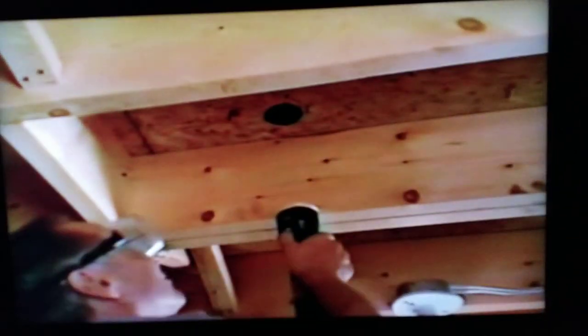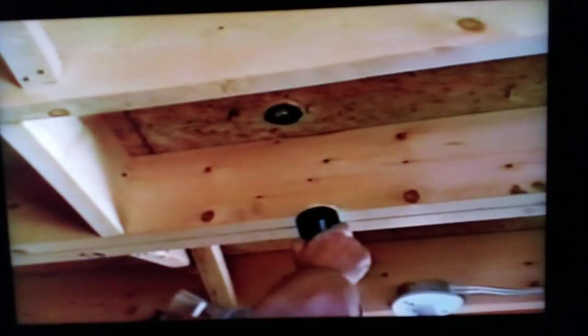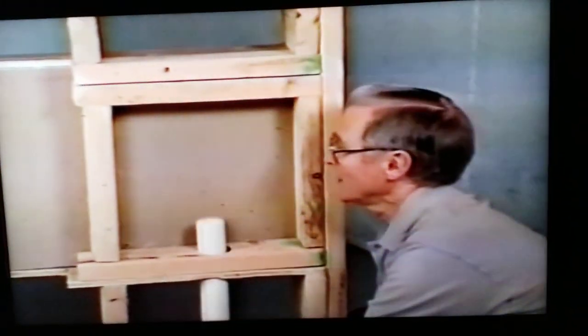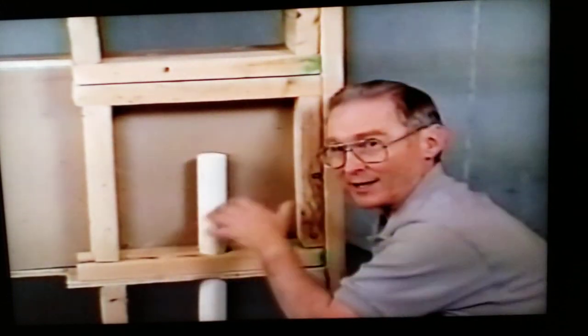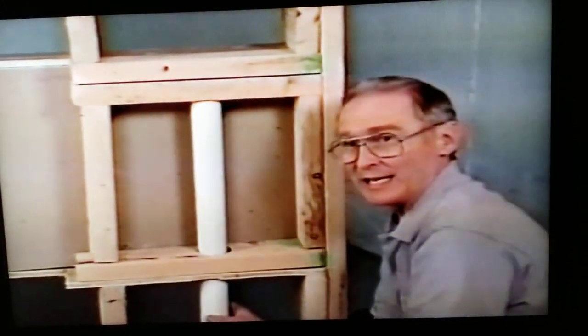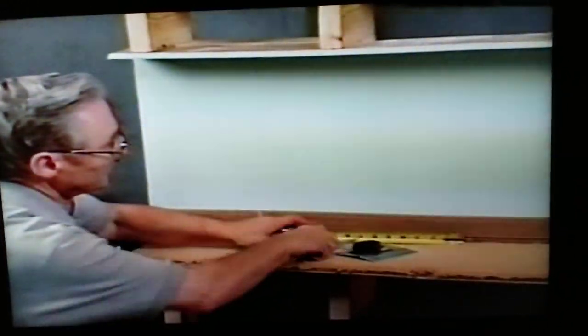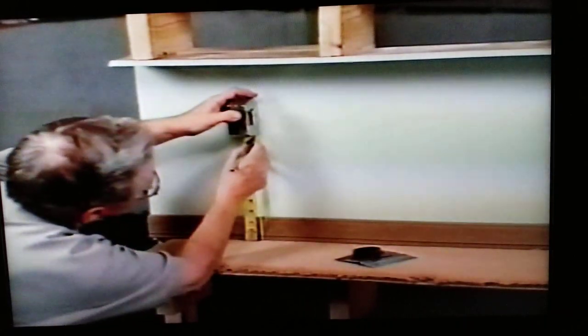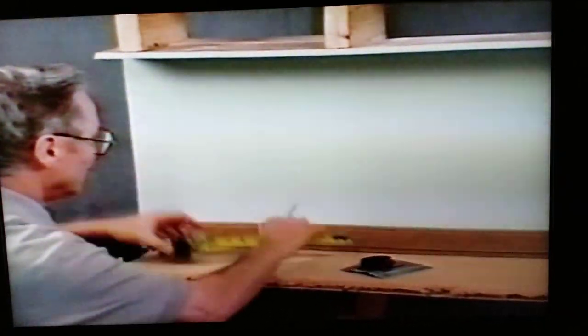First with a flashlight, then with a piece of pipe, check to see if the inner wall is free of obstructions to the desired height of the inlet valve before drilling a hole in the wall. By using this method, we can see that the wall cavity on our model is clear of water pipes, wiring, and heating ducts. Set it at the desired height above the floor, make a mark on the wall directly above the hole, as indicated by the coat hanger through the floor.